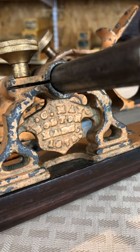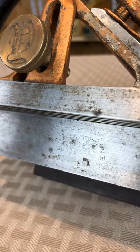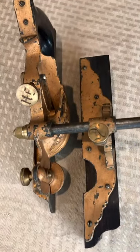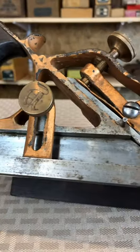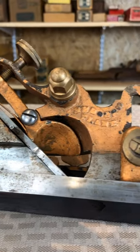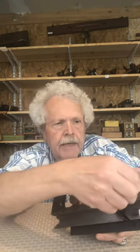Then we have the boss — the final iteration of the Mayo design — in which, instead of the red and gold pinstriping, we've got this solid gold paint. Mayo got fancy on this and cast the four initials of his name, M-A-Y-O, in the various nuts that hold the parts on. The M is a little faded, but the A-Y-O are super crisp. In addition, he expanded the base that holds the cutters in place and replaced the shorter depth stop with this full-length depth stop, which is held by two screws.